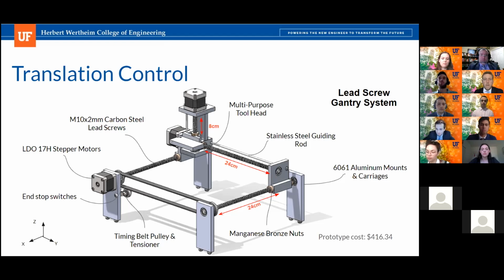And what we did was we were going to have 2 motors originally, but we decided instead of going with 2 motors, we try to run both of them with 1 motor. So we have the pulley system in place, because controlling 2 motors at the same time, especially with their price, which is on the lower end, any manufacturing imperfections could have different turn on voltages or different startup times, wind up times. So we didn't want to lose track of that. And it would be easier to do this now.